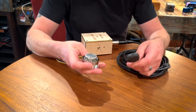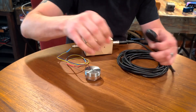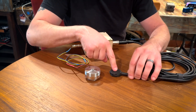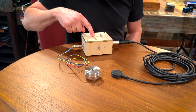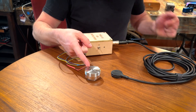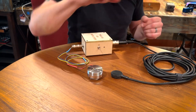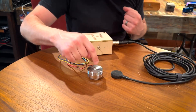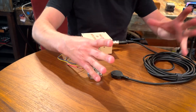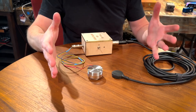So what's going to happen is that the transducer is going to send vibrations out, the piezo mic is going to listen to those vibrations and send it into the amp, back out to the transducer, which it will then pick up again. It's a bit of a chicken-and-egg situation — is this only taking in the vibrations that this is putting out, or is this putting out the vibrations that this is taking in? Over and over and over. Feedback loop.